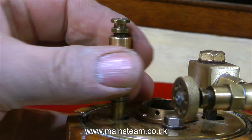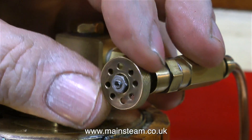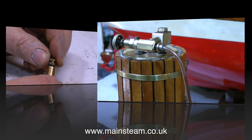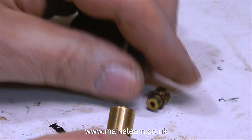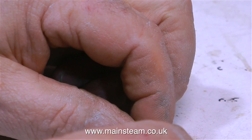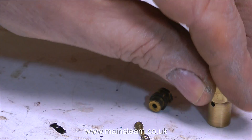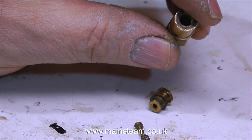This was letting the air escape at a very low pressure. The safety valve will be the first thing to look at, closely followed by this steam tap, which doesn't seem to do very much — the handle spins freely on the shaft, and the entire steam manifold is very loose. Inside a safety valve there should be a central shaft fitted with a stainless steel spring, used to press a stainless steel ball against the seat. But the main problem with this safety valve is it doesn't have a ball — it is devoid of the stainless steel ball. So every bit of steam generated is just going to be dissipated into the atmosphere.